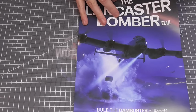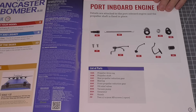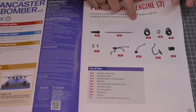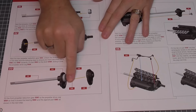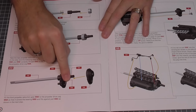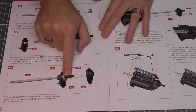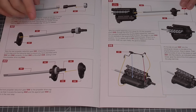So here is stage 55, and as you can see, we've got parts for the engine here. And to be honest with you, if anyone's having problems with the engine spinning once it's all together, it's actually this stage which I think is causing most of the problems, and it's all to do with these 4 things here. So when we get down to this stage here, we put this on, this goes onto here and it gets screwed in, but you need to make sure that that's very loose on there, because what I'm tending to find is that this bearing is warping just slightly, and it's giving enough friction for this shaft not to turn. If this is off, you can actually change that later on, and it's going to mean that your engine will be able to turn. Both of the engines that I've done in the past had issues with that, and that was the fix for it.